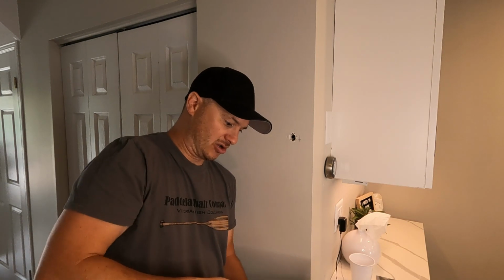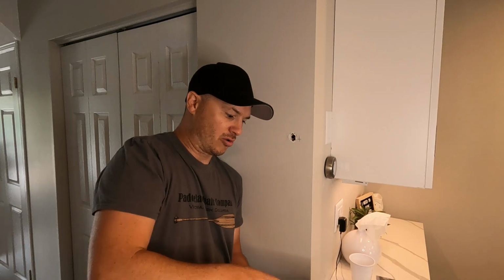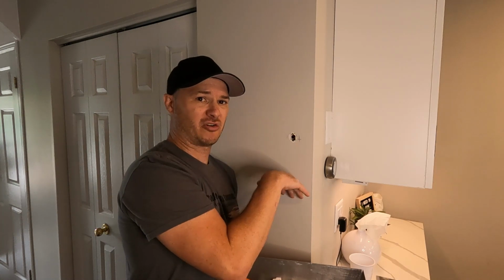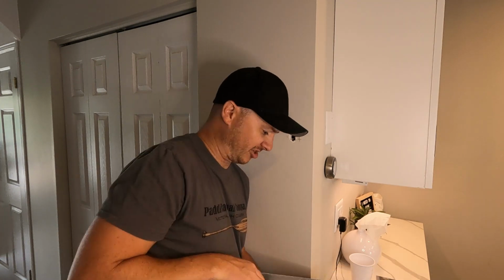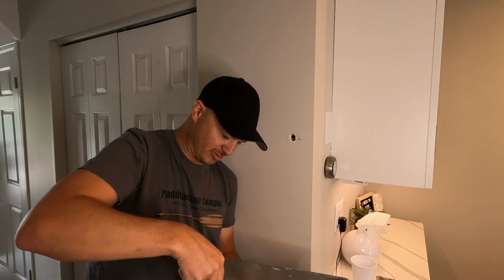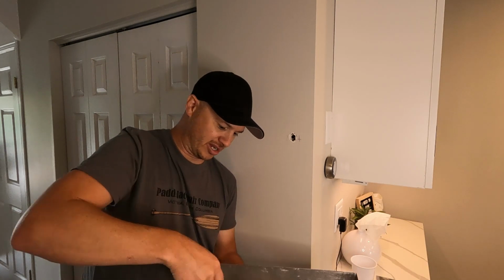Now, like I said earlier, you want to start with a little bit thicker coating when you're using this Fibafuse. It's okay to be just a touch thick. You don't want it so runny that it just falls through the hole, but you don't want it so thick that your drywall tape isn't going to stick. So I'm trying to find that balance, but I just keep adding a little bit of water, mix it up, add a little bit of water. If you think you got too much water, you can dump a little bit off right away, but again, you want to avoid clumping.